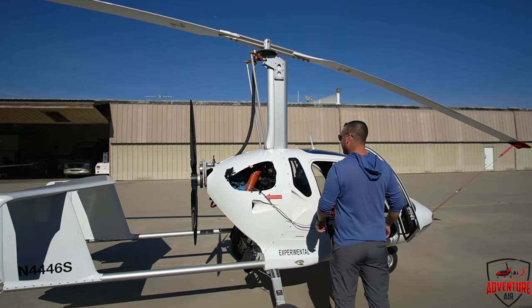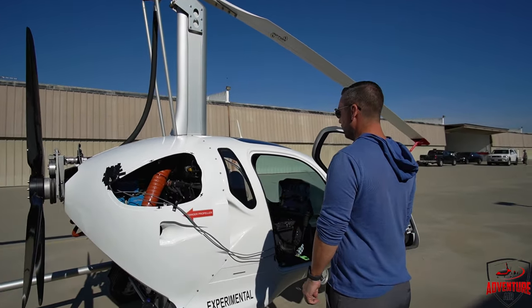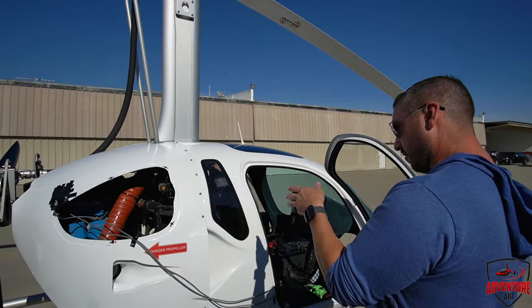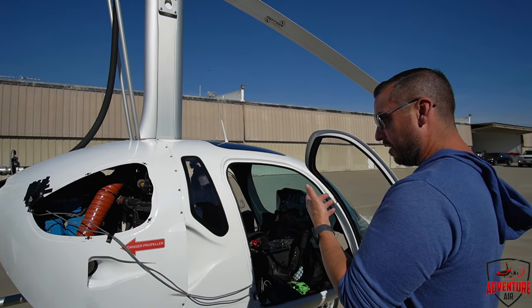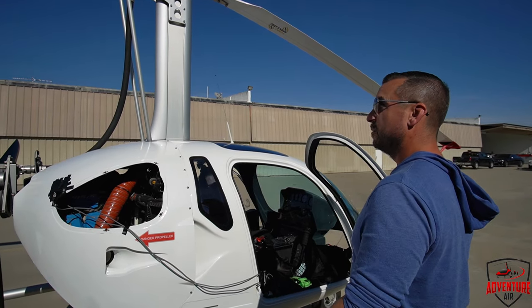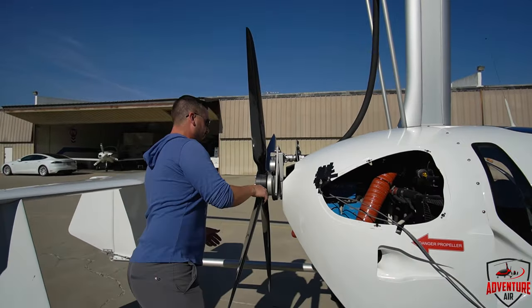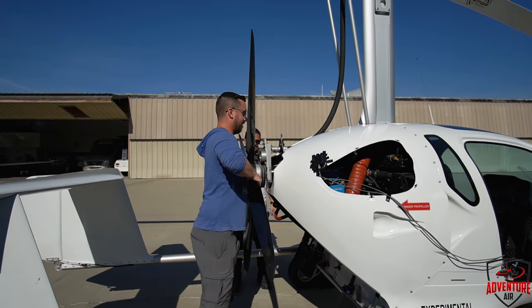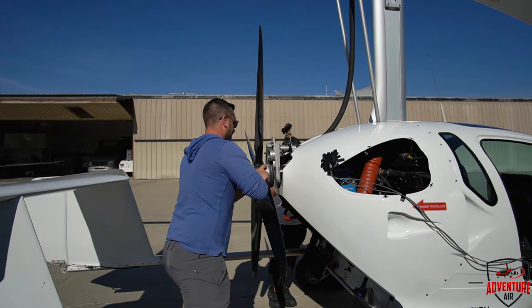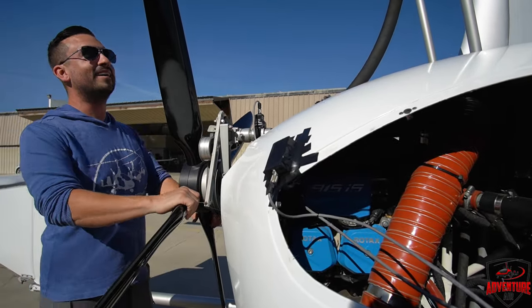Have you ever run this thing with the propeller off? Because it's literally put like a left and a right chain. I think it's not the engine then — it could be the motor mounts. I want to pull the six bolts out, but I want to pull the propeller off and run it. If it runs similar, you'll still be able to detect something on there because the motor moves quite a bit. Let me physically try to move the motor with the prop. Oh yeah, it moves a lot. They started putting a brake on the bottom — that helps, but the whole motor moves. Nothing's consistent with the changes we're making in terms of balance.